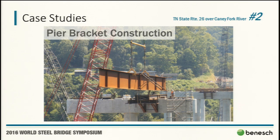There were obviously substantial wind restrictions when getting these first two girders up. When you're dealing with 8.5 or 10-foot tall girders, or whatever these were, I don't recall offhand, that are 100 feet long, that can draw some pretty big area, and even relatively modest wind loads can cause more rotation than we'd all be comfortable with.